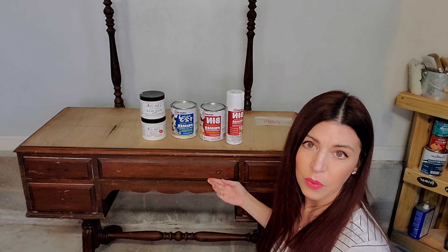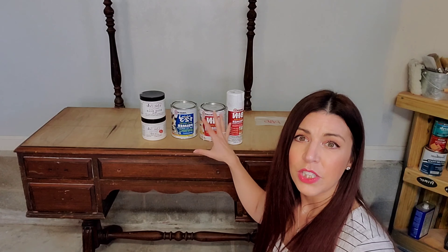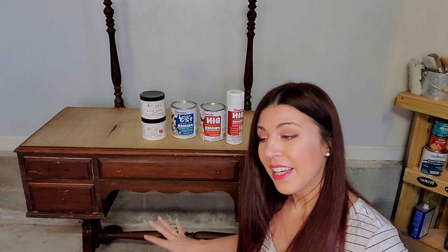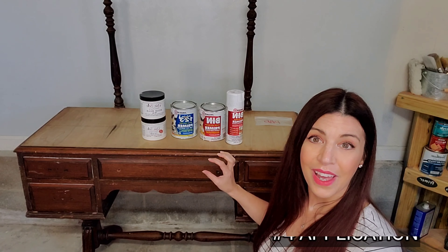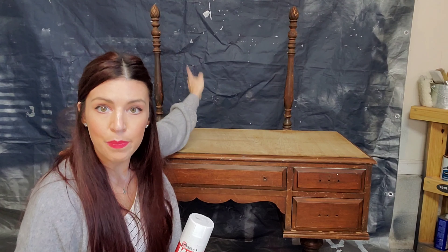The difference also between the two is smell and cleanup. The shellac has a pretty strong odor, whereas the water base isn't as bad. And the shellac, you're going to need a little bit more vigorous cleaning versus the water-based one. These are also white in color, so when you're painting something darker, there will generally be a darker primer underneath. You can either tint primer or get a darker primer — but not all primer is tintable, so you're going to have to check that out when you're purchasing it. Those are just the quick rundown of those two main products you're going to see at your hardware store.